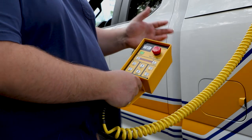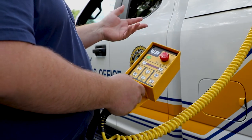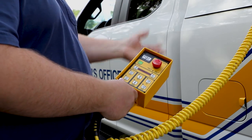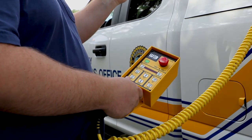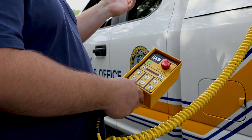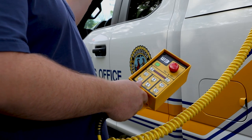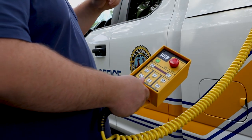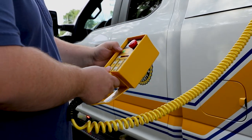We've tied the wiring for the Night Scan into the Blueprint system, so we have control over the park signal and can write a matrix for that. If we want the parking brake on and the truck in park, we can program that output to send a signal to the Night Scan. We also have a mast-up indicator so the operator knows through the cab if the light mast is up. All of this is done through the Blueprint system, allowing flexibility to program it however the customer feels works best.